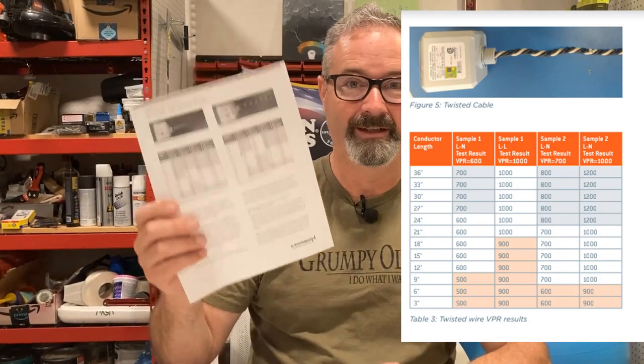When you're standing in front of a packed breaker box and you want surge protection, you need to get the best result. Unless you're willing to bury the surge protector inside your panel — which I wouldn't recommend — you have to find a way to offset the loss from longer leads. Do the twist. Sometimes just making something fit isn't as good as doing the twist.